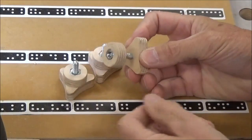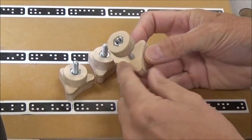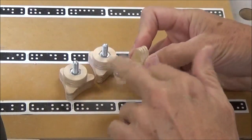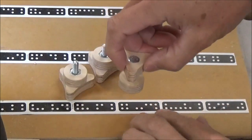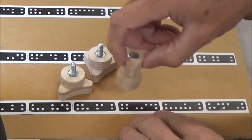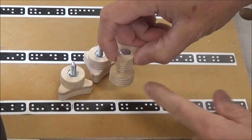Last night I made a couple of these, or three of them I guess, round nuts in tri-knobs for a 1/4 inch bolt. They work pretty slick, and the reason I'm making them is this round nut, basically if you put this in a slot, you'll be able to move it, or an arc I guess too, and then the circle becomes one point of contact for registering work.